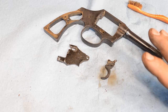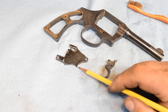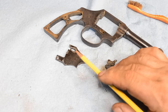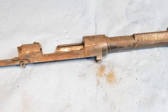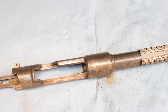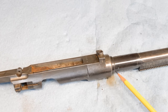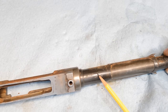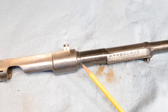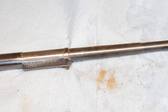We just converted a red oxide to a black oxide, then whisked off all the oxide. If I wanted to turn this plate white, all I have to do is very gently chemically remove the bluing — I don't have to grind it off. Take red rust, convert it to black rust, then chemically remove it. You can still preserve all the polish underneath it. When you're done conserving, it's going to look like this and you're going to say 'Oh my God, what have I done?' But keep going and card — and look what it looks like after carding. This is what the original bluing on an issue weapon looked like. None of that's been damaged under the stock line. We got here soon enough.